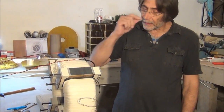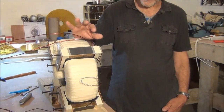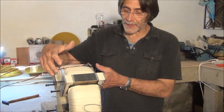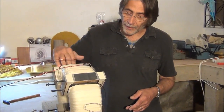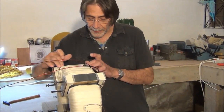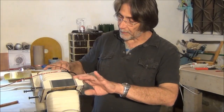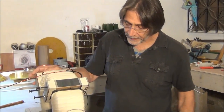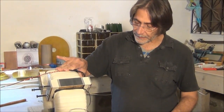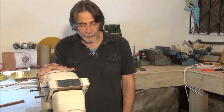We have two layers of mica tape on the bare steel, and then a third layer of Mylar tape that has very good cut-through resistance over the mica tape. That's on the bare steel core. Then there are plates made of 30-thousandths-thick mica plate covering each of the pole pieces on both sides where the wire contacts the pole piece — mica plates on each of the four faces of the pole pieces. The outer wrap is fiberglass tape to protect the outside of the wire.